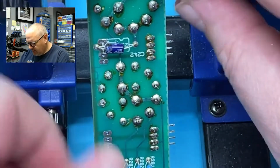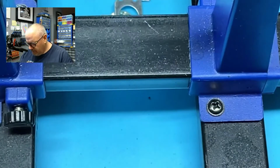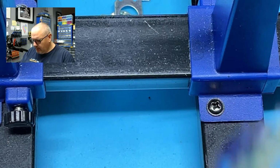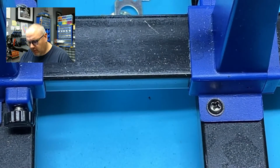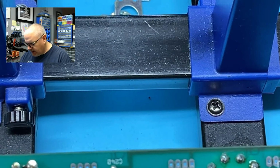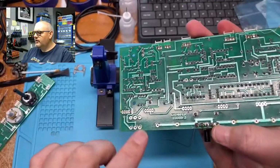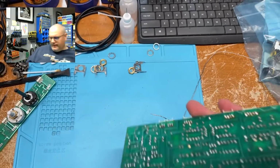Just take a little look-see at that. Looks okay. Yep, looks good. So yeah, with this one here, it's a 3-pole, and the only other one I have left is not a 3-pole, it's a 4-pole. And even if I snip the legs, it wouldn't work, so that's not going to work. But what we can do before I end this video is, where's this thing here? This pot here, let's zoom back out. Pot there, and get rid of this. That is for the mic gain.